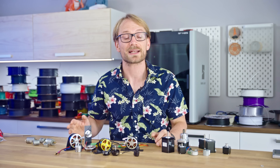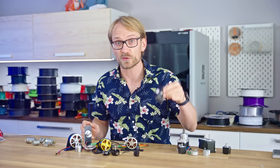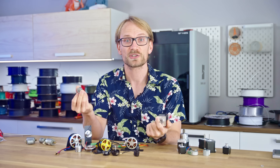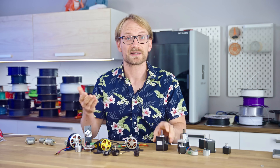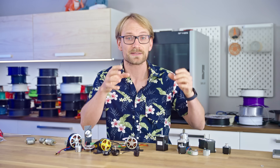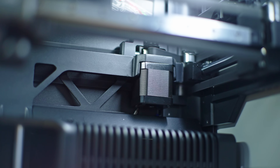All of these motors are permanent magnet DC motors. But then why do we use this one for 3D printers, this one for cheap toys, and this one for percussive maintenance of oil refineries? Well, historical reasons, but also cost, complexity, and performance. The one that right now makes the least sense to me is why we still use stepper motors for 3D printers.